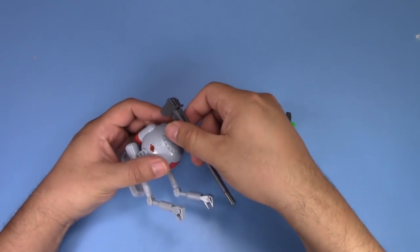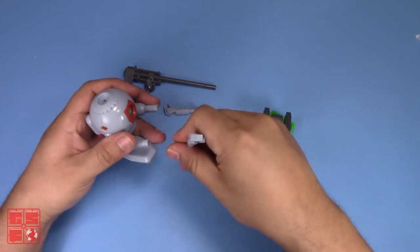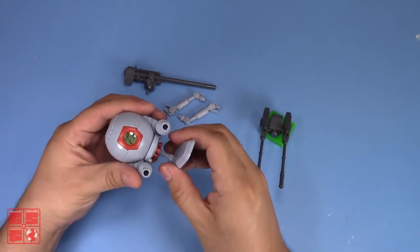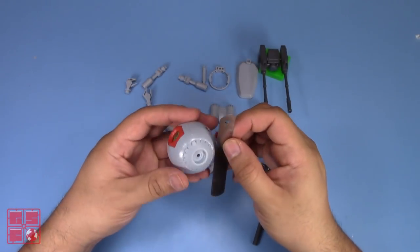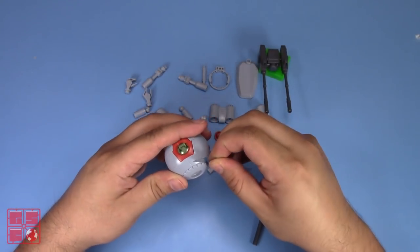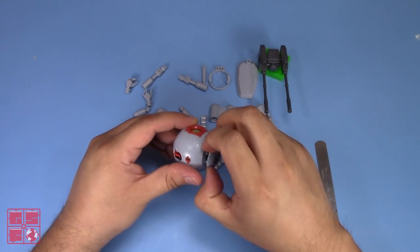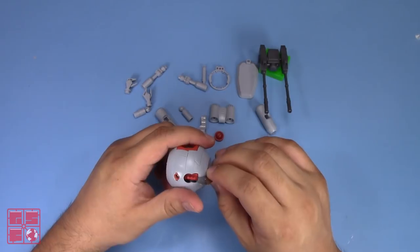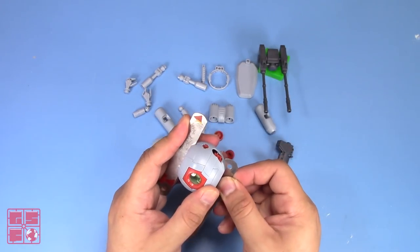The next day, I begin by disassembling the ball to get it ready for prep work. Disassembling the ball was a bit tricky, as the pieces have pretty tight fit tolerances. Instead of using a hobby knife and risk marring or damaging the parts while prying them apart, I use an old set of feeler gauges. These make disassembly much easier.